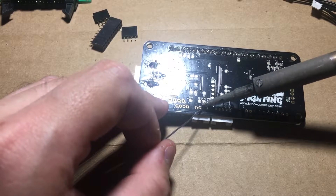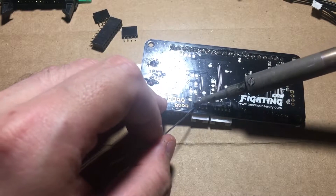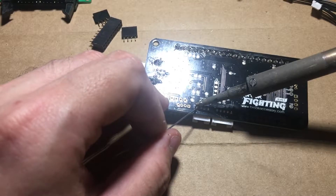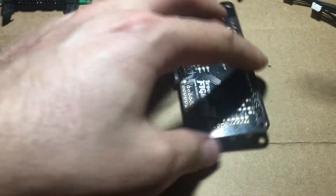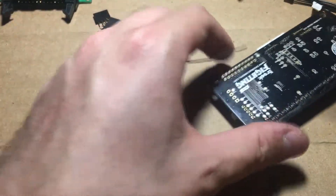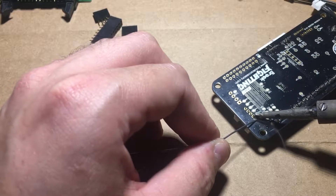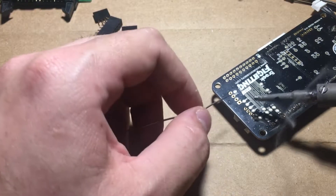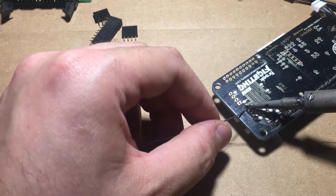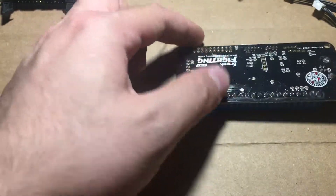Second header — this is a four-pin. If you connect any of these pins together, you can just take an X-Acto knife or a thin screwdriver and use it to cut through the solder while the iron is hot. You're not going to get too crazy. At worst you need a braid, but you shouldn't need to get a desoldering pump or anything like that. So there's our five-pin headers and our four-pin header.